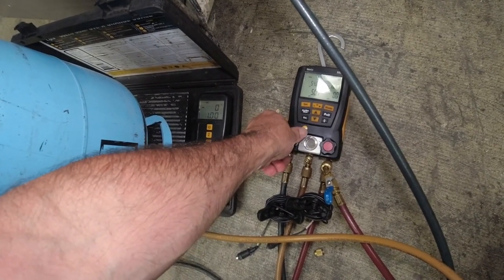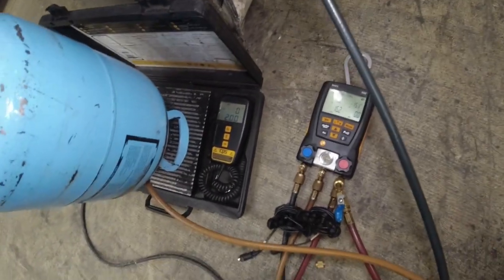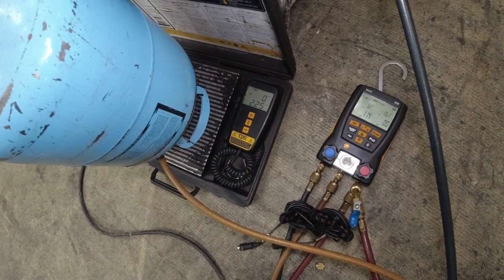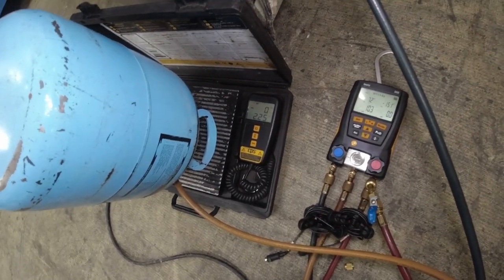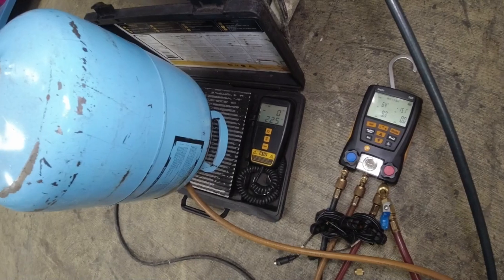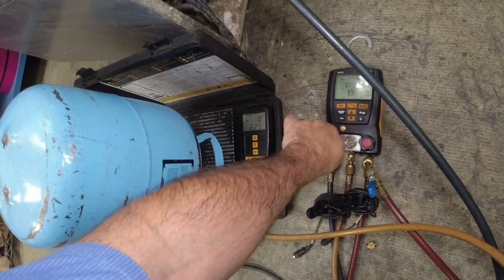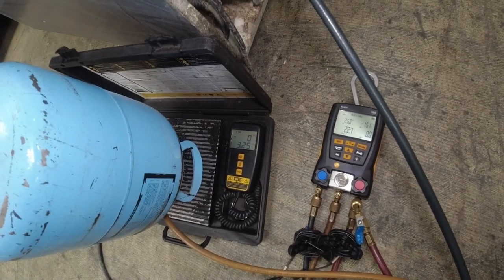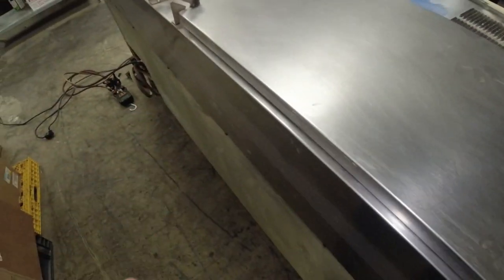They need to make their food so they can make money so they can pay you. You could always give them the option: 'Do you want me to add a little extra to get it going? It could damage the unit.' Probably won't - I've seen it done a million times - but these are options you can give them. Otherwise they're dead in the water and you're probably looking at least a week before you can get the coil. Like I always say - put it in their ballpark, let them make the informed decision. Give them all the information and let them decide. Two extra ounces, up to 10 pounds - maybe another little squirt here. We should be up to a reasonable level where it'll work.